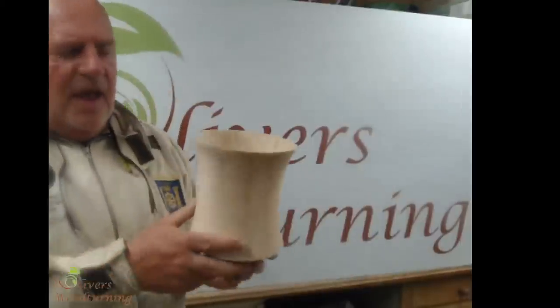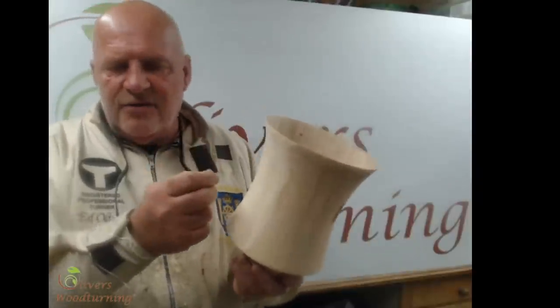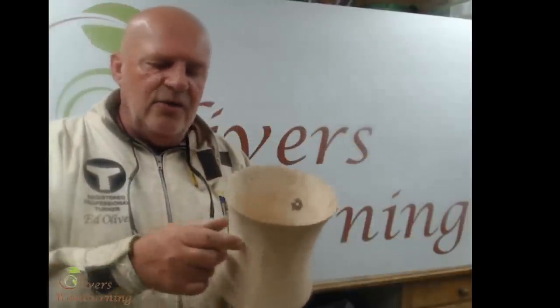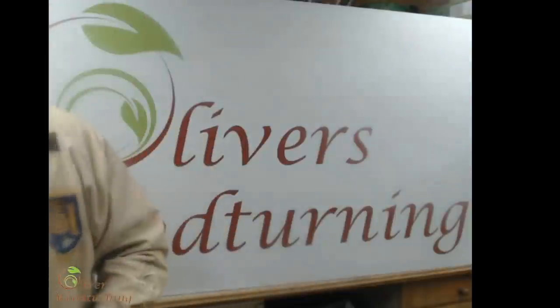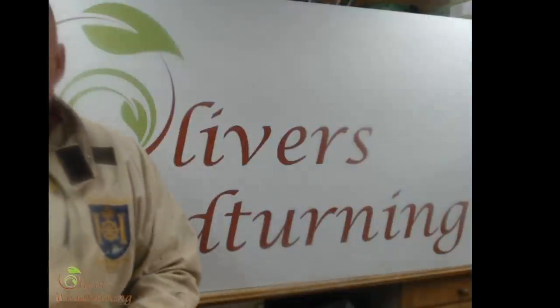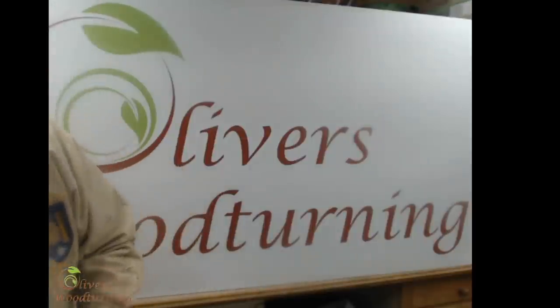But you can bring them down nice and dry, and then you've got either your finished form, or you can start piercing it and burning it and texturing it. If you're going to burn and texture something that's 2 mil, not too hot with a burner, because you'll go straight through, just touch it in. There we have it. Thin wall turning with a light without incident.